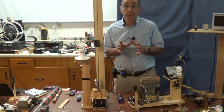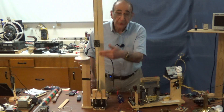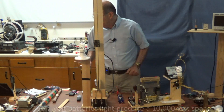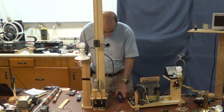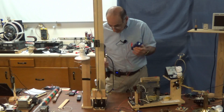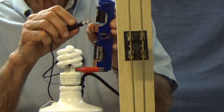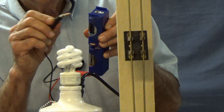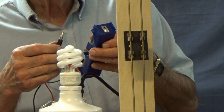We're going to repeat that process but for an actual transformer — this is the transformer that produced the 9,000 volts. First we'll work with just the primary, just like we did before, and we have the primary of that transformer connected to this bulb. I'm going to use three volts again — just two D cells. There's the bulb and here are my two batteries. I make the circuit and break the circuit. You notice it lit up when I broke the circuit. I make the circuit, break the circuit — it flashes. It only flashes on the break. I'm building up a strong magnetic field in that core.